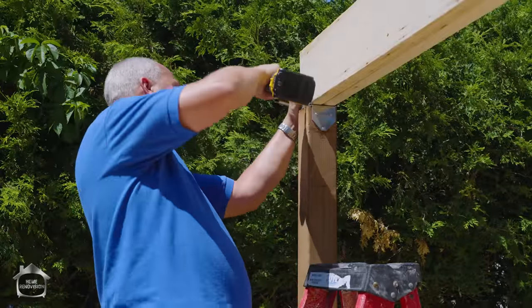We're not wasting anything. The trick here is to get all your siding on, then from the back side drill holes in the corners, cut the door out, and go from there. Matt just finished cutting my next panel over the back corner. I got the measurement for the cutoff, and I'm just going to drop my level on this, pinch where the mark is so that becomes the pivot point, and set my bubble level right there. So now I can get this measurement and give it to Matt so he can cut the angle. We're going to go a little shy because we're trimming it anyway — go to 90.